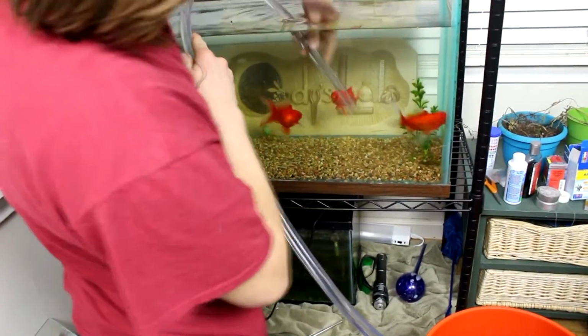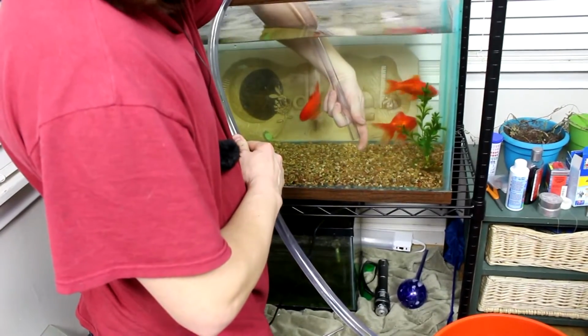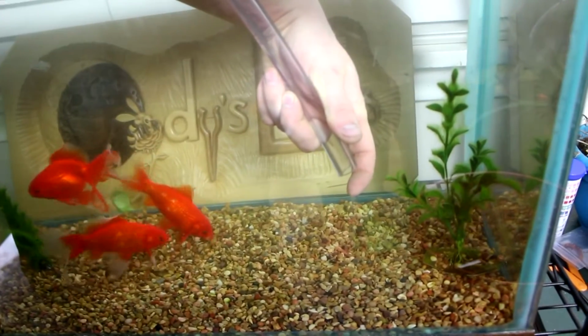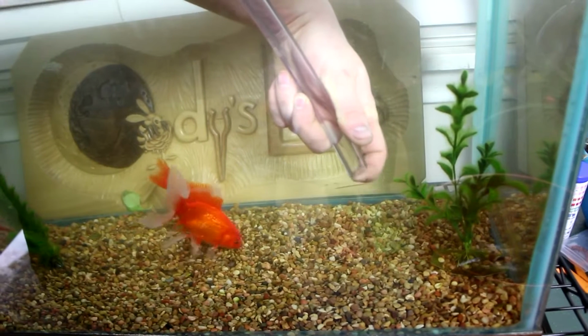Another similarity between water and electricity that makes this possible is the fact that water has inertia. In fact, I'm able to create enough inertia in the water that when it stops, the water actually creates a vacuum behind it. This here is of course a cavitation bubble, and it shows you just how strongly the water resists a change in flow. It is creating a pressure differential of at least 12 psi, or atmospheric pressure.